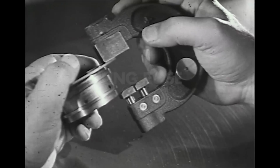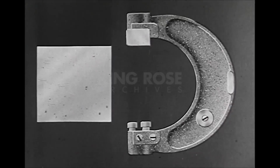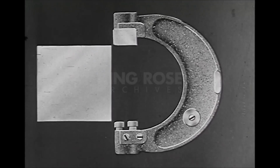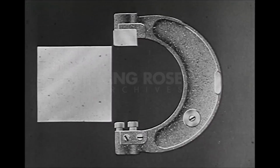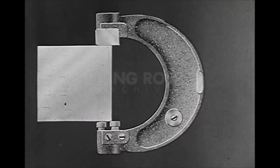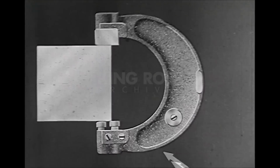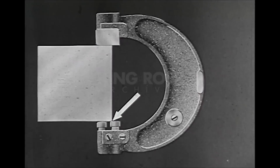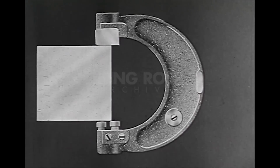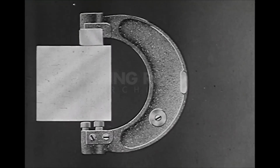Snap gauges are also used to gauge distances between parallel surfaces. In gauging parallel sides, the gauge should approach the work so that the gauging members are square with the surfaces to be gauged. Only a light hand pressure should be used. If the work is between the limits set up in the gauge, the not go button will not pass the work. However, if the work is undersized, the not go button will slide by. This usually indicates that the work must be scrapped.